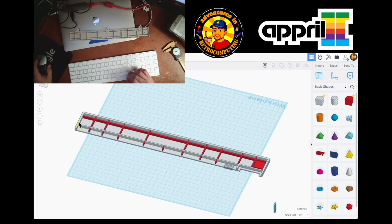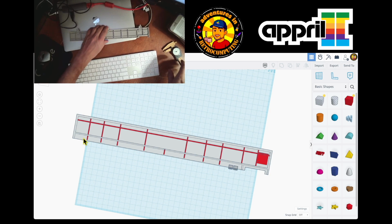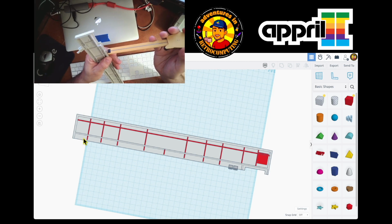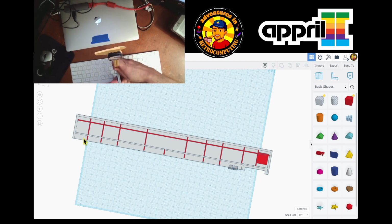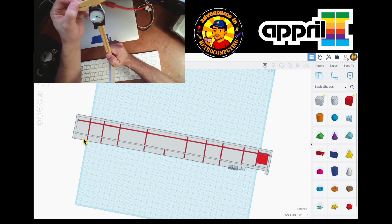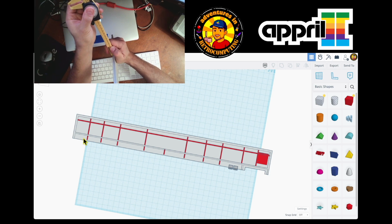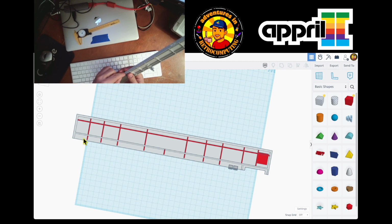We still have the rest of the lines. The only thing is that these lines, and they're not bad, actually. The only thing that I gotta make sure is that from here to here, it's exactly two millimeters. No, it's maybe a little bit more. Hold on. Take it like this. I put this in and then I open it up. So let's see. In. Oh, come on. There. It's two exactly. From here to here is two.